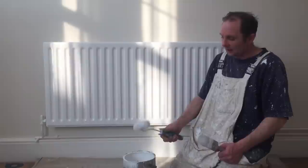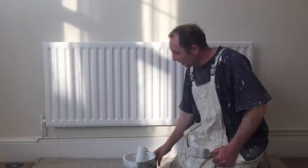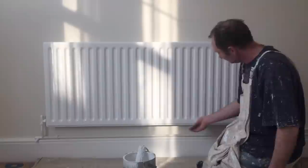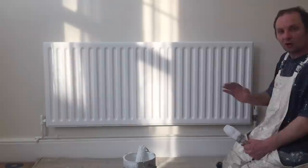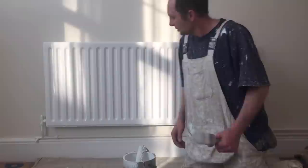Check out how to gloss a staircase — that'll tell you what roller sleeve I use for doing doors and flat surfaces like this to speed things up. Just come back in about 15 to 20 minutes and check for runs, especially on the bottom of these mouldings here. Now that's all glossed up. What I'm going to do is just turn the thermostatic valve up to about 4 — you've got 1 to 5 on that. That'll actually dry it off quite quickly. But make sure you've got a window open because you do get a lot of fumes from the paint coming up there.